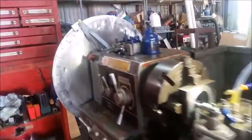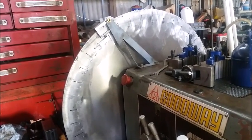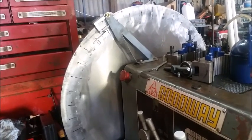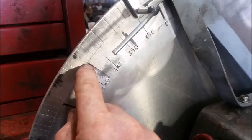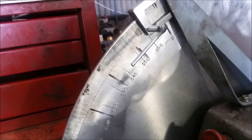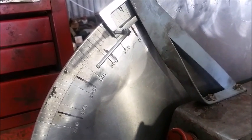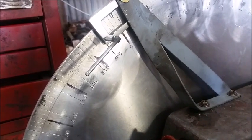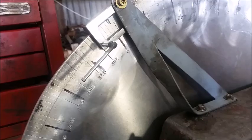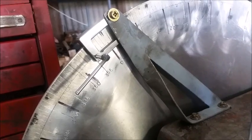We'll start up this end. This is a degree wheel that I have on the end. It's quite large and took quite a long time to make — that's so I can get some accuracy. If the degrees don't multiply into 360, I can run around there with a divider and mark off exactly where they are. I've done it and it works quite well. It takes a while to get it exactly right, but it does work. Any number of teeth or splines I can do.